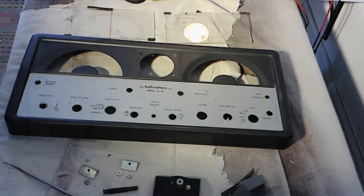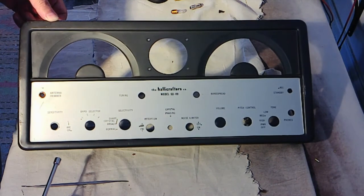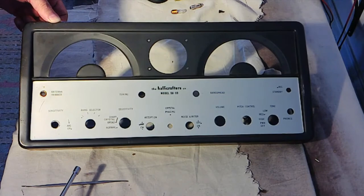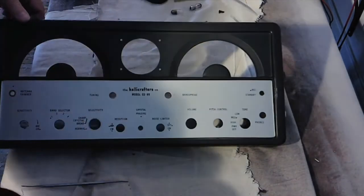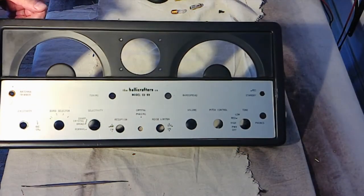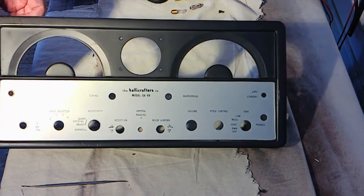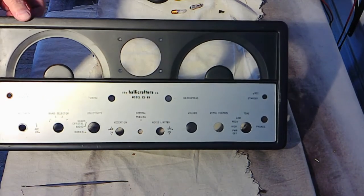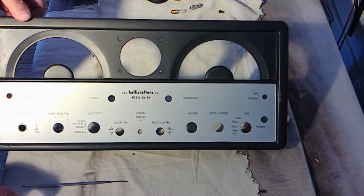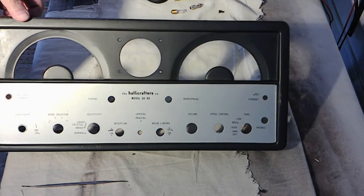I was able to clean the silver area. I used a quarter teaspoon or less, maybe a pinch, of trisodium phosphate in warm water and a shop towel, and went over it and got most of the grime off of it and spots, and a fingernail helps too. And then some of the spots I went over with alcohol and a cosmetic pad, just in the area, the best I could. Do not get alcohol on the ink. It's water, it's alcohol soluble.